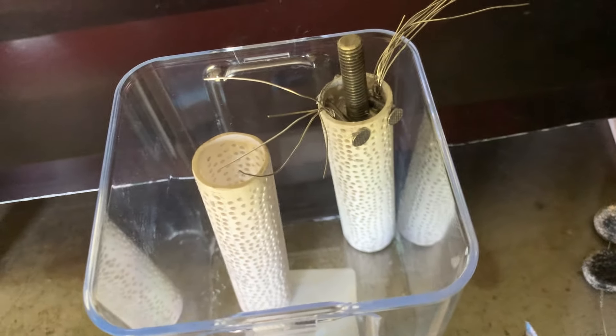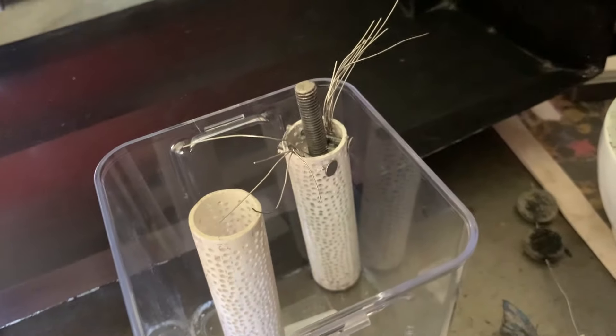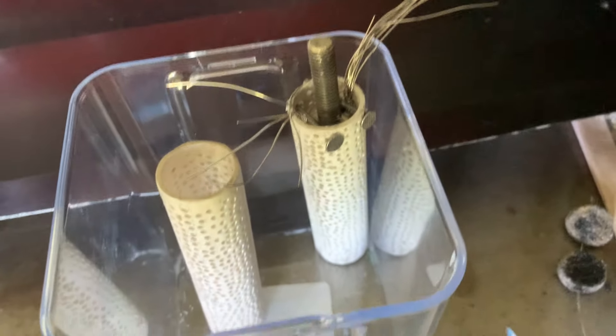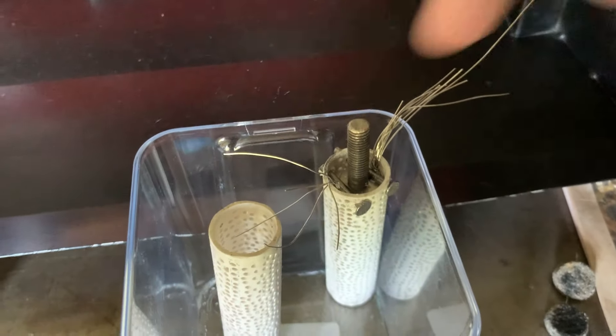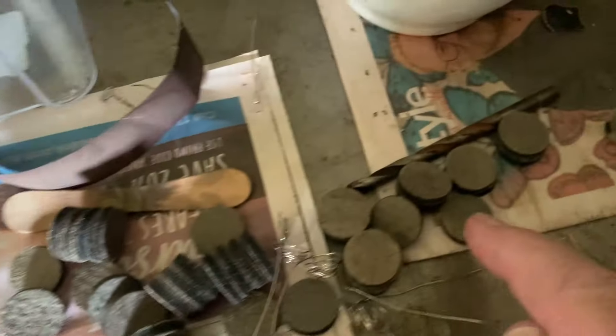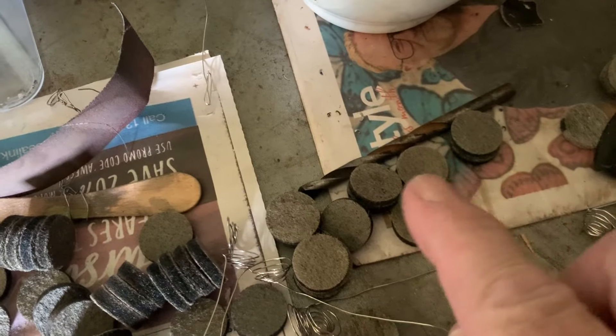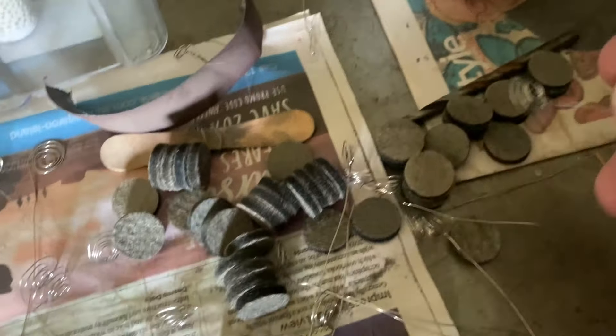I've got some time to make this PVC drilled nickel-iron battery. It's got 14 layers. We've got 14 little wires — each layer is made up of a carbon felt coated in nickel, and then I have 0.5 grams of nickel hydroxide on top. One of these little coil contacts then goes down into the tube and rests on it, and I layer it up like that.